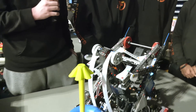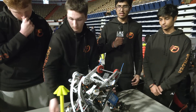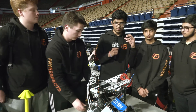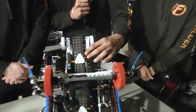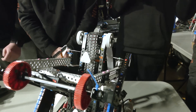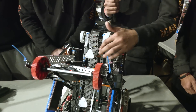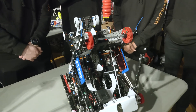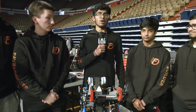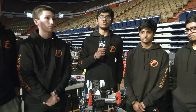Is your team doing any color sensing? Yes — Roosh will cover that. At our previous two competitions, we didn't want to intake the opposite color ring. We have an optical sensor sitting very narrowly inside the intake to keep it compact. As soon as it detects the wrong color ring, it stops the intake briefly, and the ring's momentum carries it off instead of flipping onto the goal. This means the driver doesn't have to outtake — he can just intake, flip the ring off, and get to scoring wall stakes and positive corners faster.